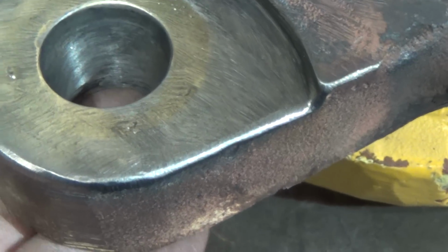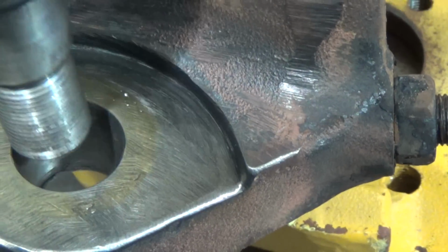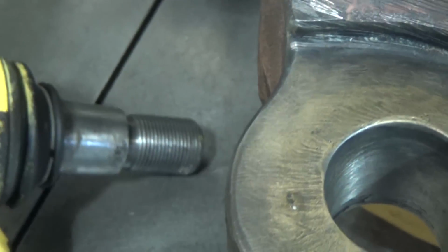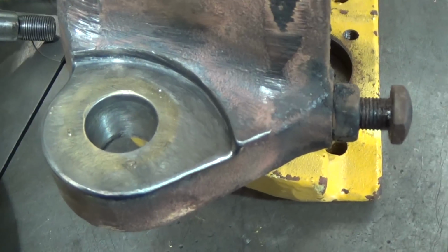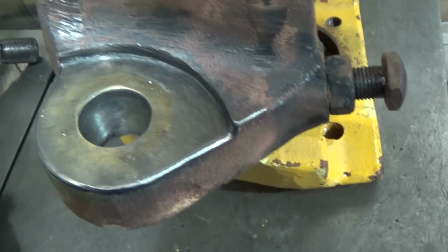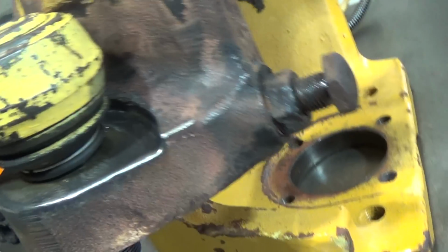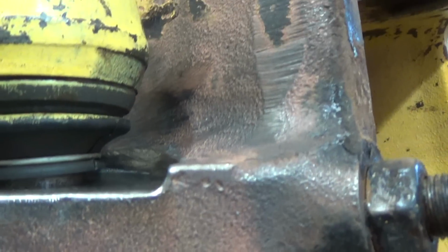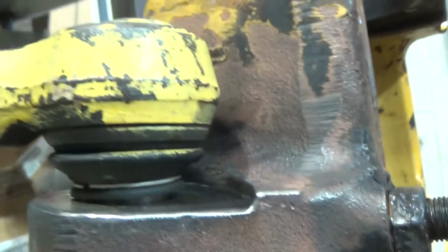And I left it just shy on the underside so that when this thing goes in, naturally it gets a washer or something on there. It will naturally be squeezing on the component, not on the new bushing. So that's what I did. And I thought it went pretty well. I got the taper pretty much right. I was satisfied with the way it fit in. Obviously, you can see it gave enough room to do the take up there. So I got that pretty well squared away.